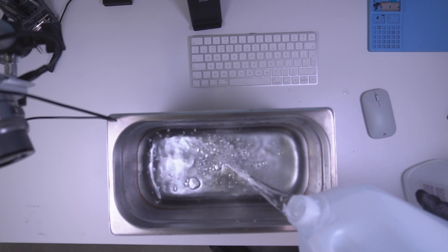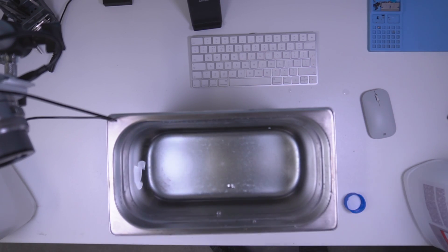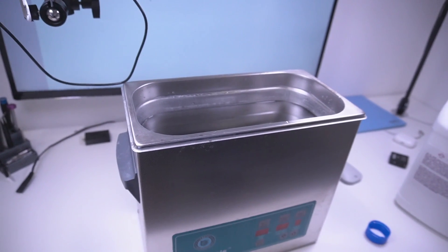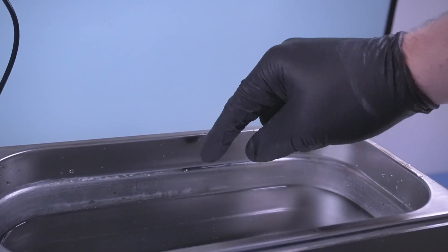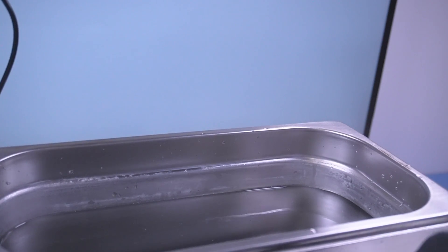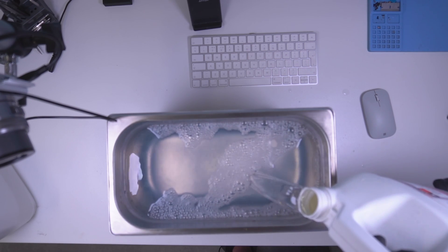I normally don't do this on this desk — we have a separate desk for this. I'm going to fill it to about 90% full, leaving roughly 10% until the fill line. Then with this Flux Off, which is specifically made for PCBs, we're going to fill the rest of the way to the fill line. It smells quite a lot like a window cleaner actually.